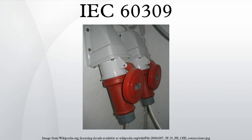The most common ratings are 16A, 32A, and 63A, with 125A and 200A less common. Construction sites in Central Europe have most of their higher-power cabling set up with this three-phase socket type, as the single-phase to neutral voltage of 230 V is available for other devices. So-called power splitters with this connector as a three-phase inlet and three groups of single-phase outputs with individual circuit breakers are generally used to achieve load balancing across the phases, important on generator supplies. Similar configurations are used for outdoor exhibitions, festivals, and large events.